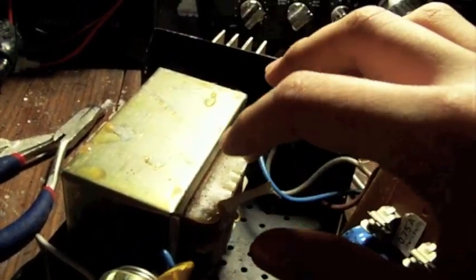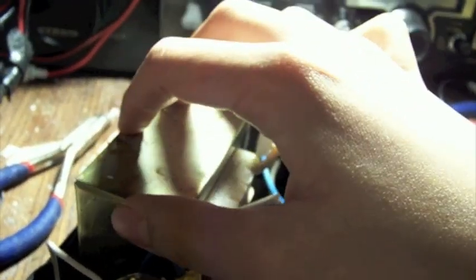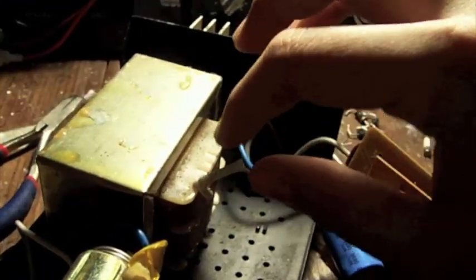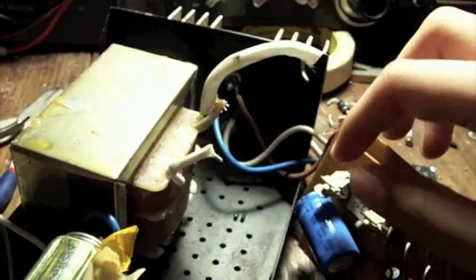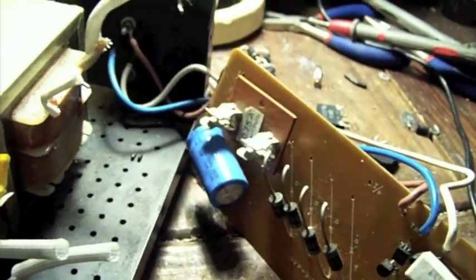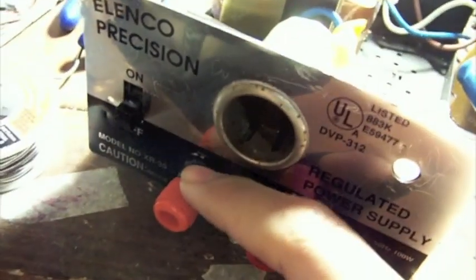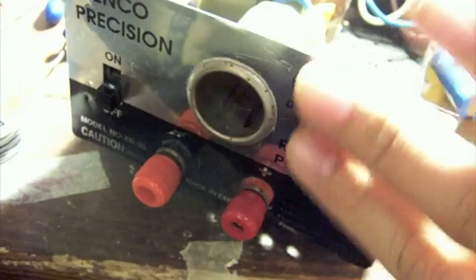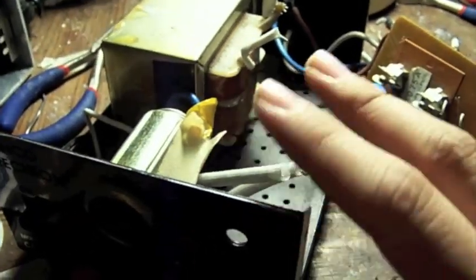So if you disconnect your power transformer and your fuse is still blowing, then you know it's something wrong with the power transformer or something in the power cord. I went ahead and disconnected my power transformer in this one anyway, even though the fuse is after the transformer in this circuit. I tested the voltage on the transformer and everything is okay. Next I disconnect the power leads that go to the front panel, just in case there's a short from one of the positive posts onto the grounded area. But that was okay and there are no shorts there.